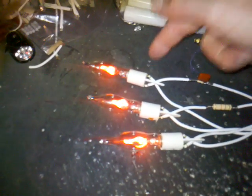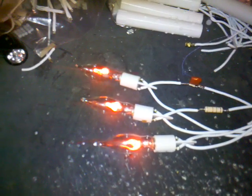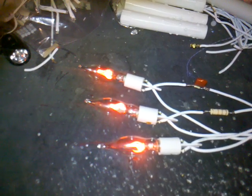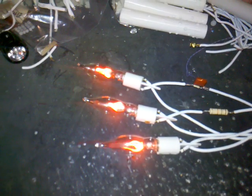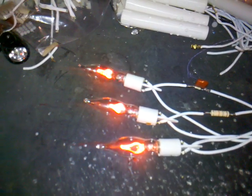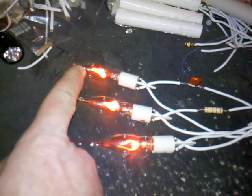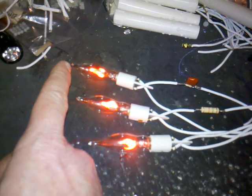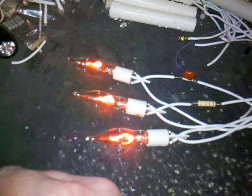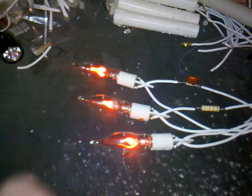The third one here: I put a 100nF 400V mylar capacitor in series with it, along with that discharge resistor. It has reduced the power dissipation to 0.4 watts — that's around about a third of the original power dissipation — and you can see it's dimmer but there's still as much movement around it. I measured the current through at 4.16mA, but a lot of the power is being limited by the capacitor, which means there's no significant heat dissipation.